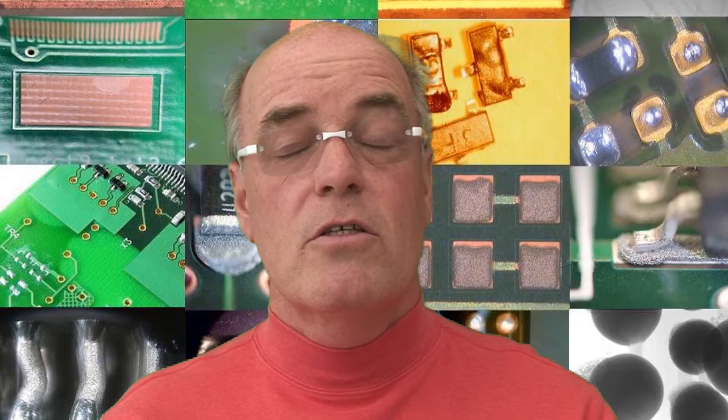We will inevitably see some damage to the joint — initial crack propagation through the bulk of the solder, perhaps because of mismatch between certain surfaces. But that gives you confidence in the joint and reliability. We can speed up this process sometimes by doing shear testing as part of an environmental test program, seeing early evidence of the effect of temperature cycling on solder joints or solder alloys.